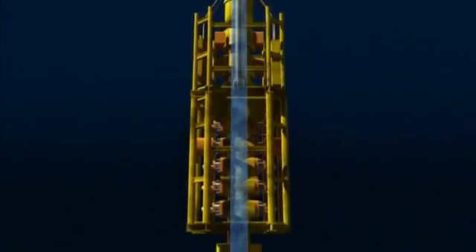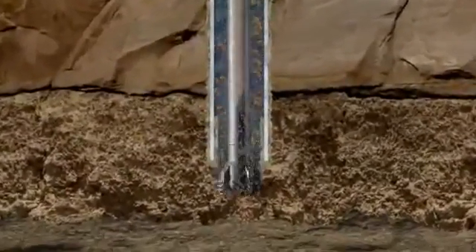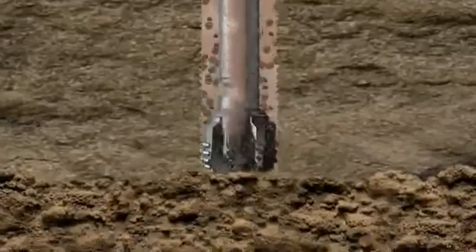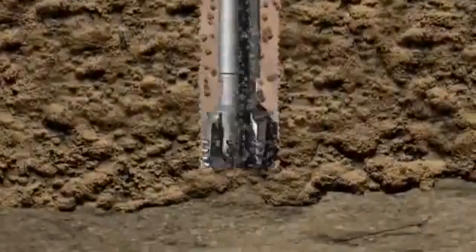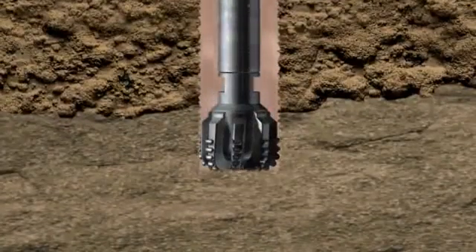From this point onwards, the drilling procedures are similar to those used to drill an onshore well. With a riser in place, seawater is replaced by a special fluid known as drilling mud that is pumped down the string and exits through ports in the bit. The mud not only cools the bit, but also clears the cuttings from the hole. The cuttings are captured at surface and examined by geologists to characterize the rock types that are being penetrated. As drilling continues, sets of decreasing diameter bits and casing runs are used as the well penetrates deeper into the rock.